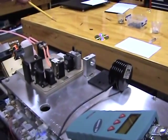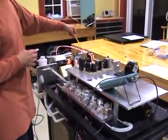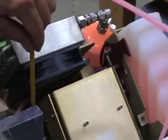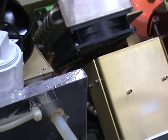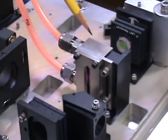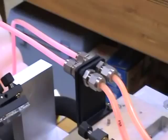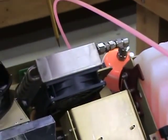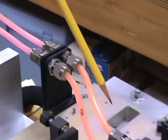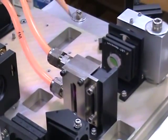The modifications haven't changed the overall layout of the laser, which is fairly straightforward. The dye solution is stored in a reservoir — about 1 liter of it — and it is drawn out by a pump that's under all of this hardware. The pump moves the dye at a relatively high pressure, about 40 psi, to the dye cell, which consists of two quartz windows separated by a small metal spacer. The dye then returns through a radiator to remove heat built up by the pumping process, through a particle filter, and back to the reservoir to complete the loop. The dye is pumped under relatively high pressure because it needs to move through the cell at a fairly high velocity — on the order of meters per second.